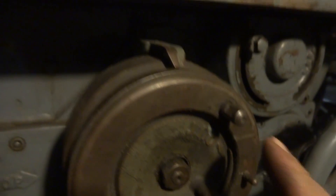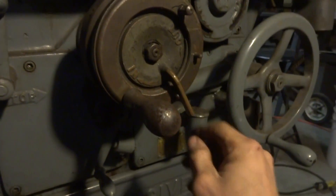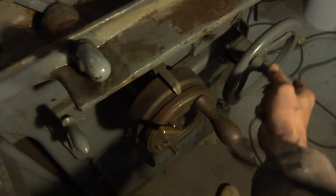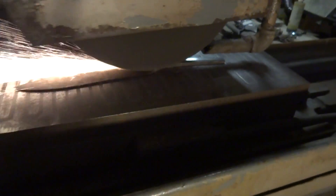Now, if I want to, you can see how that says 'in' and that says 'out.' We want to move the table in, so I pick that with the selector here. Now when I crank this either left or right, it'll kick over automatically the amount that I have adjusted it to using these bolts under here — one's for the left and one's for the right. See it kicking over? It's set at maximum kick-over per stroke of the table, so I don't have to keep cranking the Y-feed wheel.